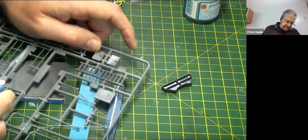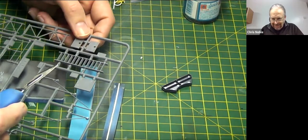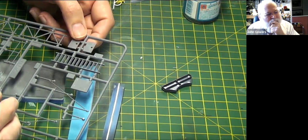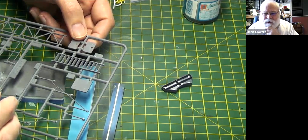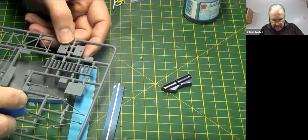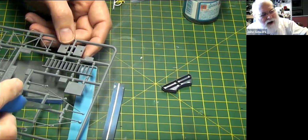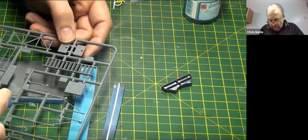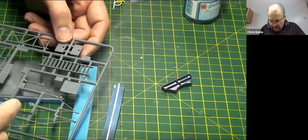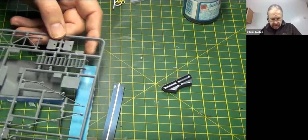The only thing I thought of was a slitting disc and a mini drill, where you're actually cutting it, then dealing with it with the sprue still attached a little bit, because by cutting it you wouldn't be producing any outward pressure. That's true, but I wouldn't want to go into an area as tight as that with a slitting disc. I meant, for instance, where your knife is, where that upright goes up, I'd perhaps cut in the middle of the two that go either side, so you've got it separated a bit, and then deal with it. You could. I don't know if it would help, but there's no trick that I'm aware of other than being very, very careful. That would be my advice. Okay, thank you.